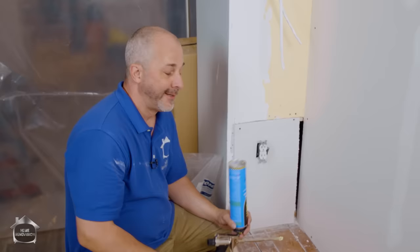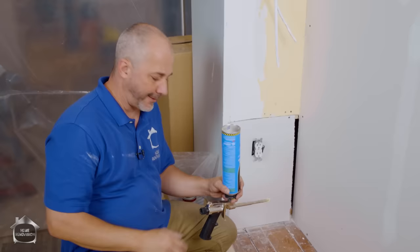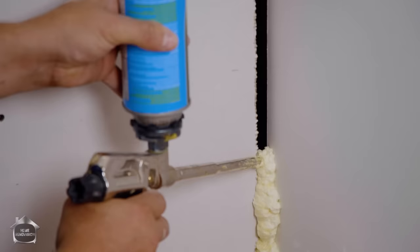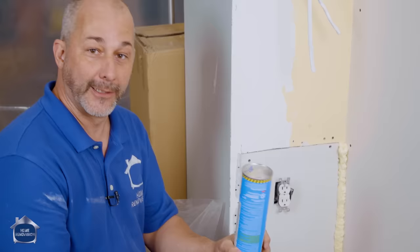So one question I get from first-time renovators is when they've done all the installation and the last piece of drywall isn't quite big enough, or there's a big gap in the ceiling in an old house where the ceiling has a bit of a bowl to it and you can't install everything square and level. Again, take out the foam, open it up pretty healthy, shoot it at the corner so it has something to hit, and it'll expand in and out of that corner. Don't worry about how much of a mess it makes. The goal is that when it's done drying, it's expanded in behind and gone solid so you can trim off the face and have a backing to do your taping.